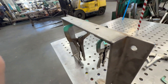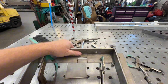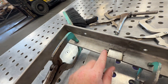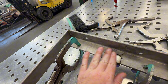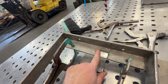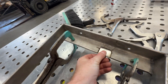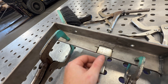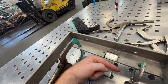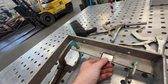I can drop this side down a little bit — yeah, that's better. Lay it down like that, get this piece on. Now it feels a lot better — sitting nice and flush. I'll take my clamp and clamp it on. I like to take a little flat bar and put it on, bring this piece down and butt it up against it, so it looks nice and even after I grind and weld it.